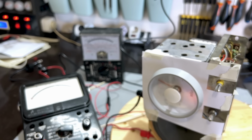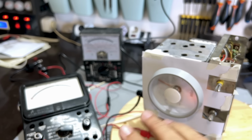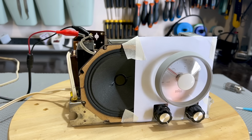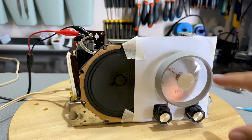And I was missing one of them, and the reason was this thing was completely shifted. The 88.5 was all the way over there, so it was very, very shifted. And now I think I've got it done. So, RF alignment, done. I made a slight adjustment to this. They tell us to set this to 88. And 88, I believed, according to those markers, was right at the end. Well, it can't be, because it tells us that this thing receives between 87. So what I did is I put it to the end.